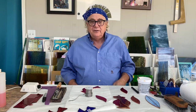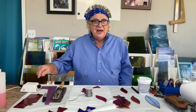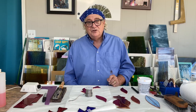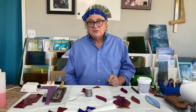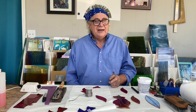Today we're soldering and giving you tips on how to make your soldering work look really nice. Your soldering iron is very important — this is a typical studio iron, a 100-watt iron. I don't recommend using anything less than 100 watts, and your next thing is going to be a rheostat. Otherwise you're going to burn your iron up quickly and you won't be able to control how the solder beads up. Solder too hot doesn't bead up; solder too cold doesn't bead up. You've got to get it just right. Using a rheostat or wattage controller will help you succeed, and I can almost bet that if you're having trouble soldering, you're either working too hot or too cold, or you've got the wrong iron.